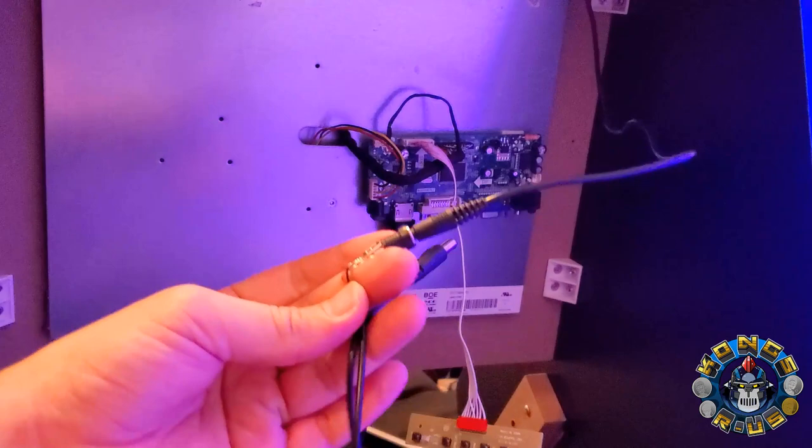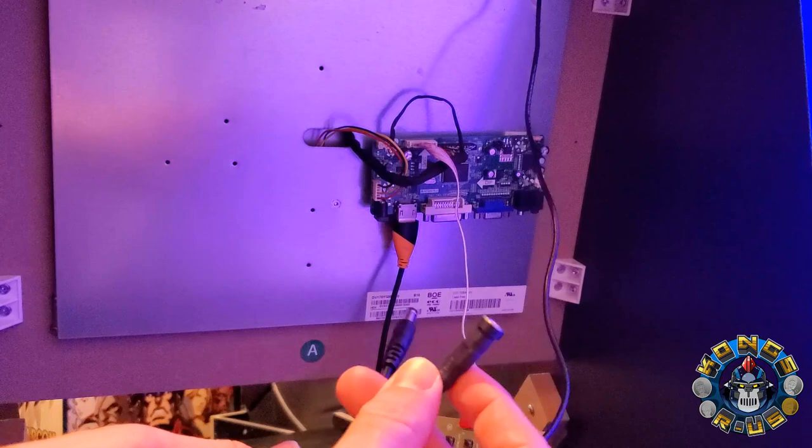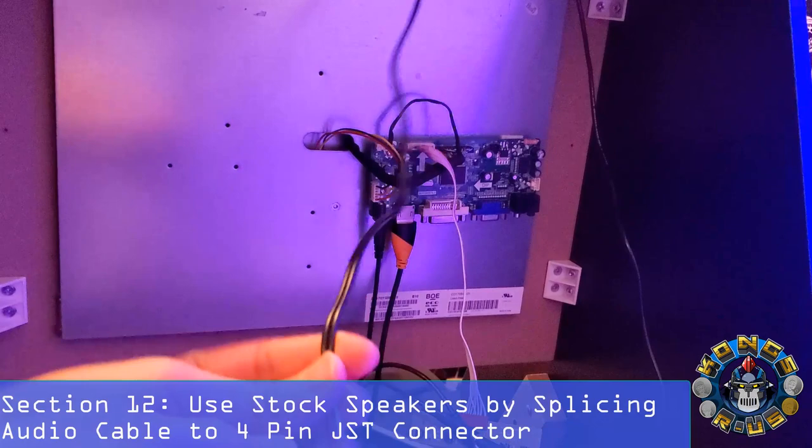If you're comfortable with basic wiring, there's also a female adapter where you can cut the ends of one of the Y splitters and wire up small spade connectors from your Perceiva kit, plugging them into this adapter. Use electrical tape so the wires aren't touching. This gives you a Y splitter where one end goes directly to your display adapter and the stock marquee plugs into the other — a cleaner option. You can also just cut the wire and plug into a standard 12-volt adapter.